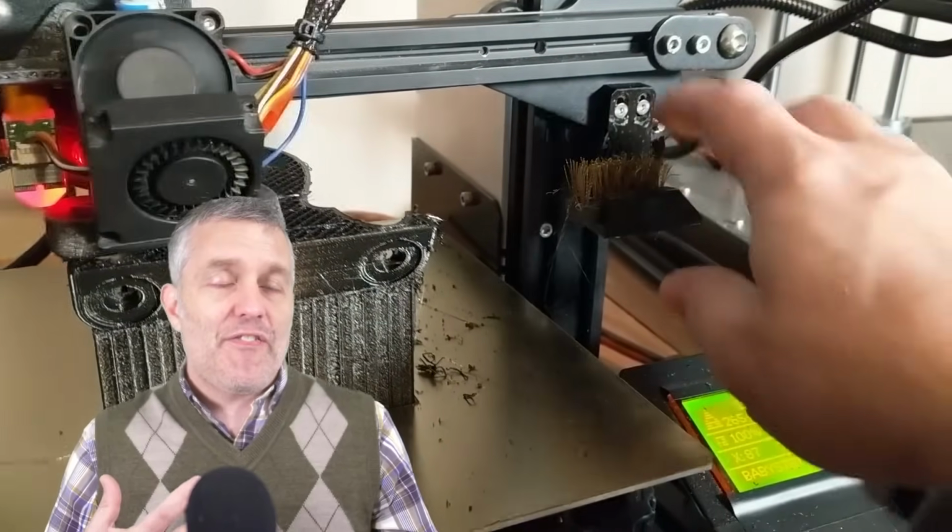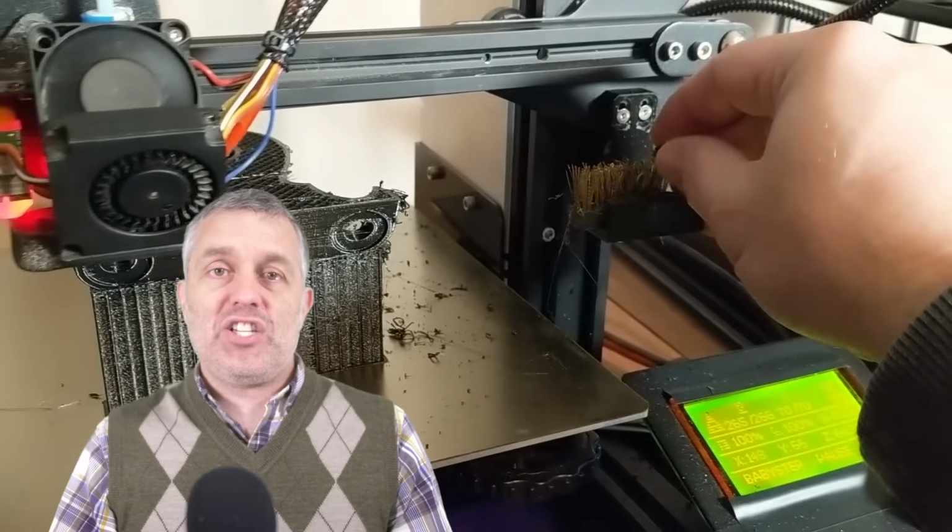But basically, if you have wet PETG filament, you're going to have severe problems with stringing, and that stringing builds up on the nozzle, which makes a big glob of filament on the nozzle, which is kind of sticky. And as the nozzle's passing over your print, it's likely to catch your print and tear the print off the bed or cause skips in the print, that sort of a thing. So you have one of two solutions here.